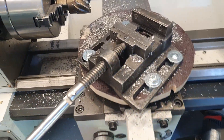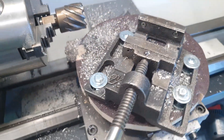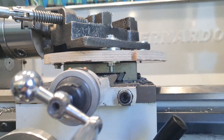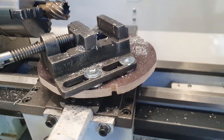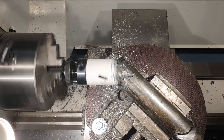I considered two methods for cutting the saddle hole: using a lathe or my new magnetic drill. I even made a separate video about how unique this drill is. I started with the lathe by removing the tool holder and attaching a V-block. Everything seemed fine at first, but then I ran into a problem — the hole saw has a depth of 35 mm, and during drilling the tip of the pipe starts hitting the bottom of the hole saw.